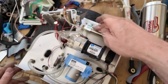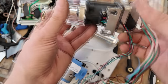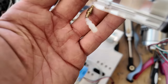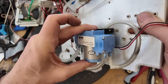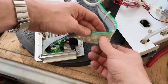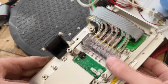Close up to some of these pneumatics — we've got a small air reservoir here, a much bigger one buffering from the compressor, and then this interesting piston thing with what looks like an encoder. This produces precise pressures and/or volumes to squirt out to the various biotech stuff. The compressor is mounted on rubber mounts to stop it vibrating everything to pieces. There's a bank of eight valves going through a pneumatic ribbon cable up to a manifold, which then connects to the replaceable cassette, plus a rather nice acrylic manifold we can take off for a closer look.